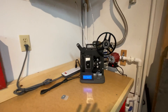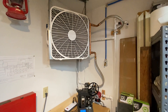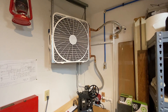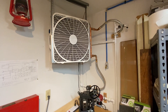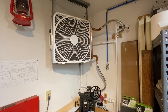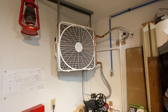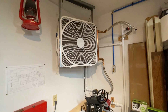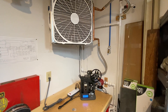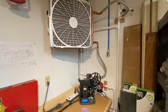It works. The shop is about 800 square feet, slab on grade, fully insulated and sheetrocked. The temperature in here without the system can get up to 78 or even 80 degrees even when it's 85 or 90 outside — so it's quite well insulated. What I've determined is it really only handles about a three to four degree temperature change, and if you open the doors a lot or have the garage doors open, you'll end up with the system running away.